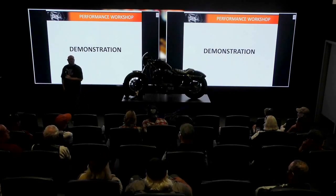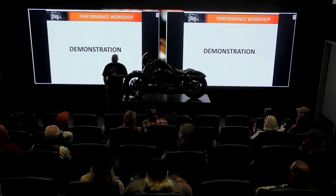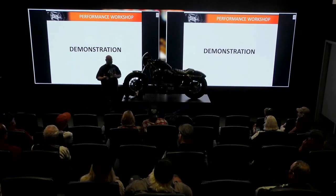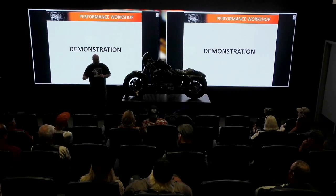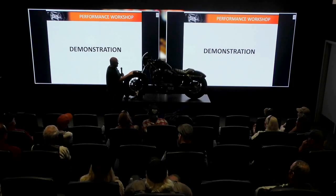How long does the hydro-dipping process take? I wish we had someone here from Spooky Fest, do we? Is anyone here from Spooky Fest? Hydro dipping is actually a fairly quick process, the dip itself, to apply this. This stuff here comes as a film, and it's basically floated out in a water tank. The part is prepped and cleaned. They take the part, they dip it through the film slowly. The film adheres to it, and then it dries and cures, and then they clear coat over the top of it. So when the coat goes on, it's sort of a matte finish. And then they spray a paint clear coat over the top of it to get that shine.